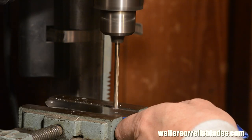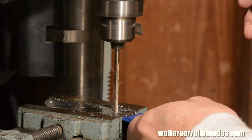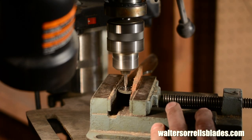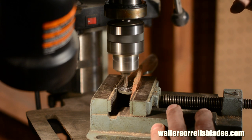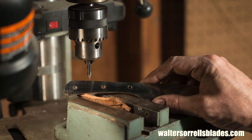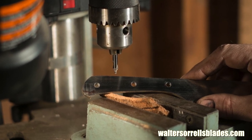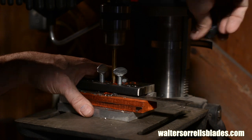When I first made knives I tended to just slap the knife blank in the press and start drilling. But drill bits will wander if you use this approach and that can be enough to make your handle pins end up in the wrong place. So next I'm over to the drill press where I'll drill the holes using a combination spotting drill and countersink. These stubby little drills are great for the knife maker. Conventional twist drills have a tendency to wander, causing your hole to be off center, which looks bad. These little suckers are much more accurate. You start the hole with the spotting drill, then you put in your regular twist drill and drill it all the rest of the way through. If this whole process seems a little burdensome, I'll show you a much quicker way of drilling accurate holes in a later video — in fact, that next paring knife video I mentioned earlier.